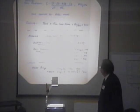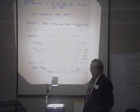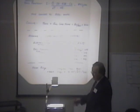What efficiency rate do you get on that electric strip? Is that 100% efficiency? Well, yeah. Virtually every watt that goes in comes out as a BTU, except for a very small amount that might be lost in the furnace. But it's virtually 100%. OG&E put on a lot of control units on their air conditioning.